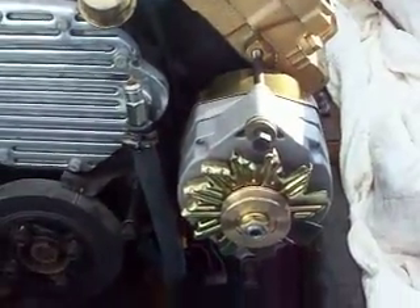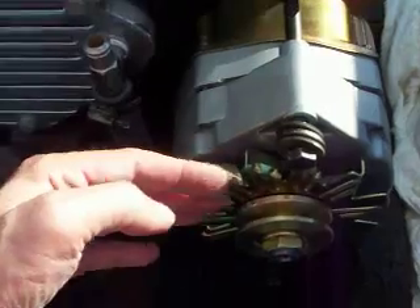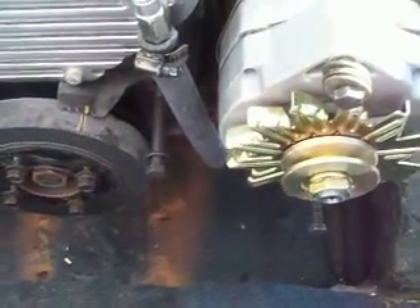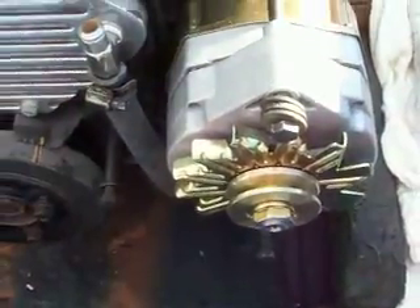Today's interesting thing is re-engineering the alternator mount. One of the things was that the alternator was mounted farther down on the block, but since there was not a marine alternator on here before, I got a new marine alternator with the cap on the back, and it couldn't swing to where it was, so I'm going to have to move it from this bolt up to this one. What that means is there are some bushings that go here. The front-to-back alignment on the pulley is a little bit wonky, so I got some big bushings here that need 3/16ths of an inch taken off.